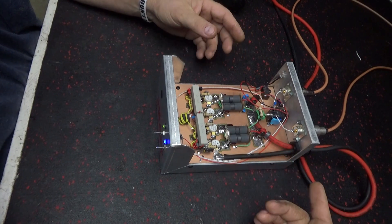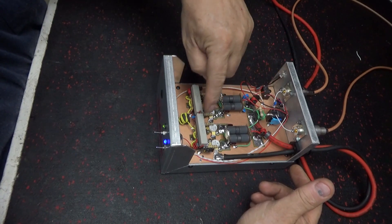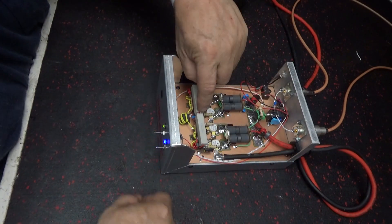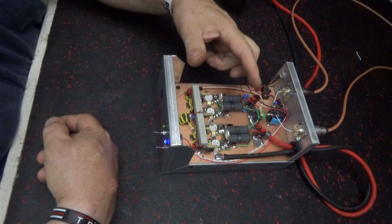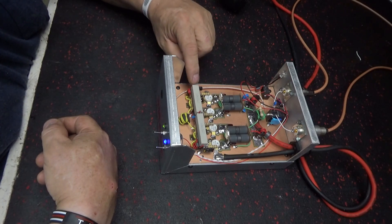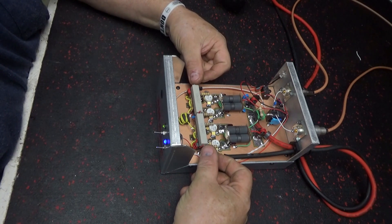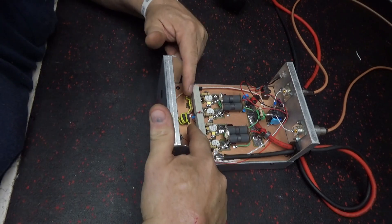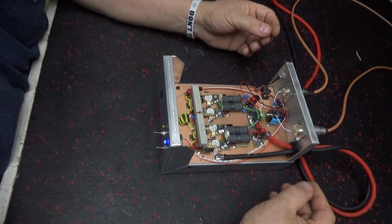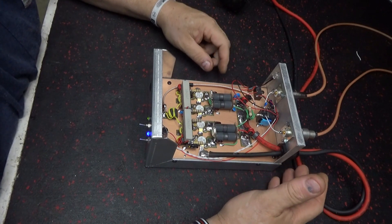It's on AM now. And AM has a carrier, so it looks like it's longer than it actually is. But if you go to sideband where it has no carrier, it's completely different. You can check it on AM to start with. That's all it's doing — taking this relay, sending power when you key the mic, from here to here, over to here, to send through all these block resistors. They're dissipating the heat that's going to come out. So you're coming in with 14 volts here, bleeding it down a little through there, and these are shunting the ground. Whatever goes past that gets bottled back — it goes back and stays here, and you're catching that little bit of voltage off of that and putting it to the input of the transformer, which is the input of the transistors, and it's keeping that transistor on.